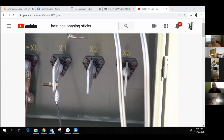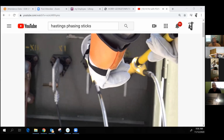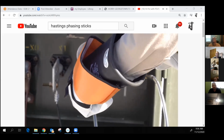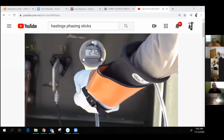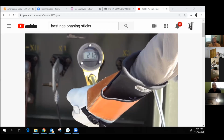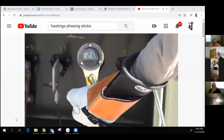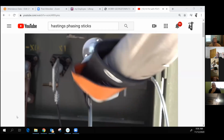The next test is what's considered a known voltage test. Since we know this three-phase pad mount is energized and we touch the X2 and X3 bushing, we should get close to 208 volts. You can see from the meter display, we get 212 volts. So now we know this meter, the second probe, and the interconnect cable are all good. This is what we consider a 100% test.